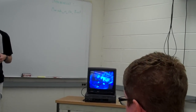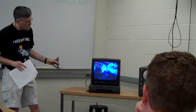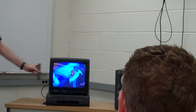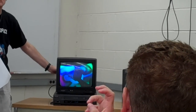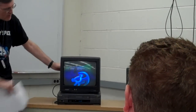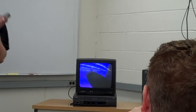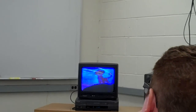We're going to take the north pole of the magnet on the right side of the CRT. Bring this in. What's happening to the picture? If you look at it, this side is going down, more so on the right side. What's happening here is that the electron beam is interacting with the magnetic field, and we're getting a downward force.